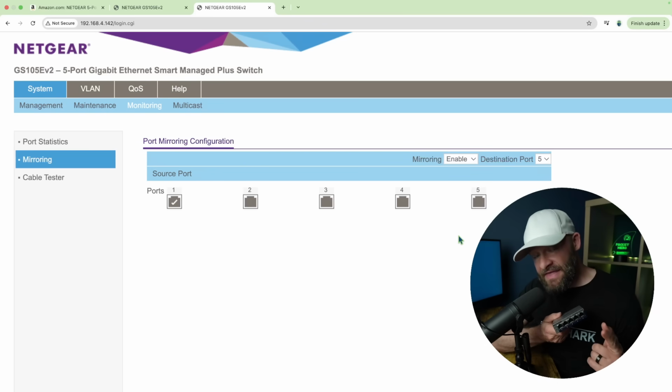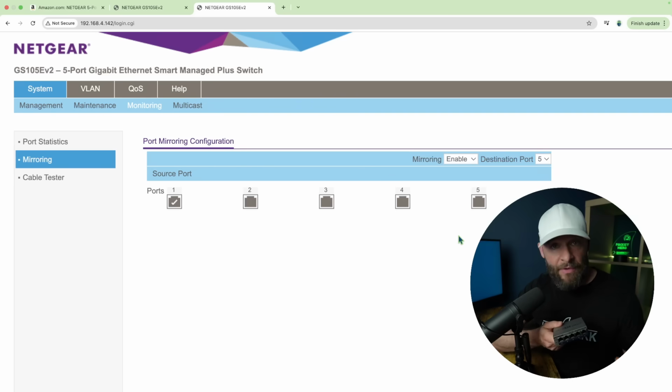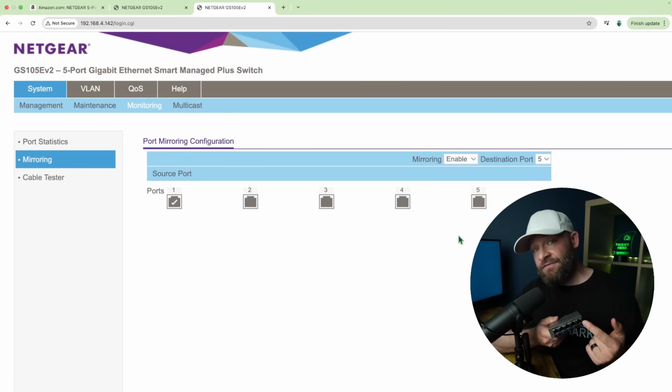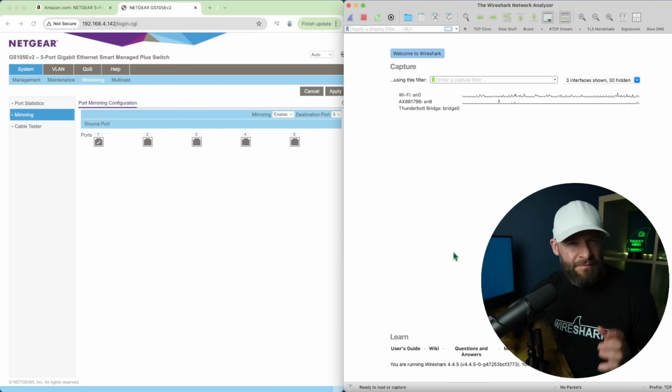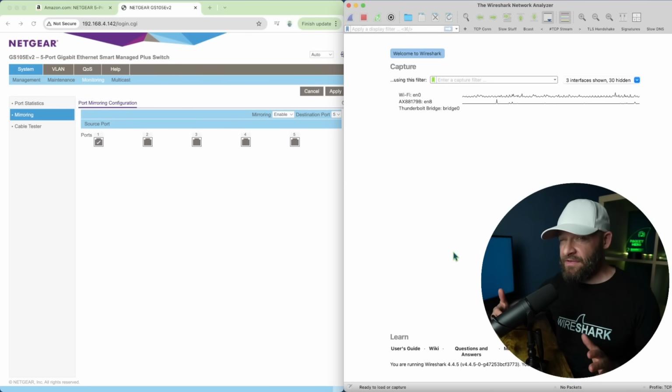Now, in addition to that, if I have any devices over here that I need to manage, so let's just say that I'm remotely connecting to an analyzer that I have snapped in here, this will still accept packets. So that's a pretty interesting feature as well. You can still transmit into that monitor port and receive traffic back out. But before we really trust this user interface, let's actually make sure that it really works.